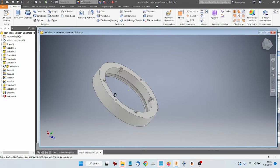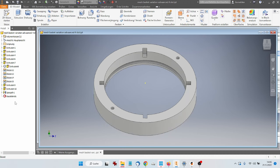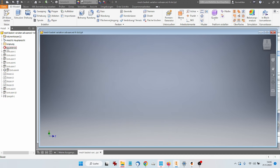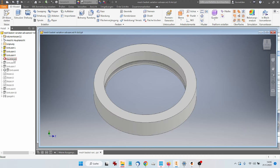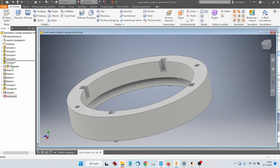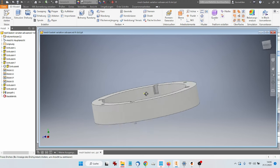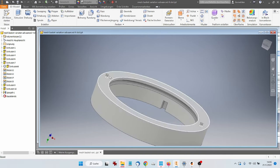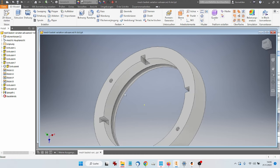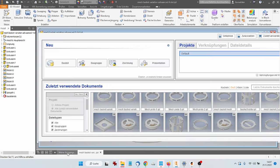As you can see it's roundish. It's a really powerful program — it costs a lot of money but I have it through work — and you can basically do everything with it. I'll show you the different steps: there's the base, then the wall built around it for the mesh, the two slots for the walls, and the two holes for the pins. There's also a little inlay where the mesh wafer comes in. I considered putting in a piece of mesh but that was unreliable since the mesh could bend easily. So I bought this mesh wafer — it's about 41 millimeters across with a thickness of almost 1.8 millimeters — and you just press it in during the print.